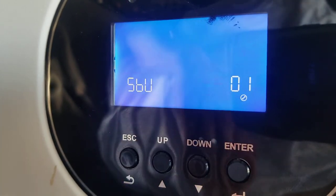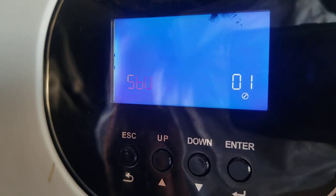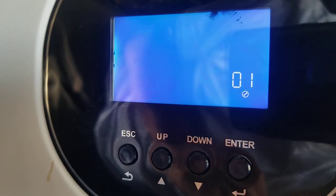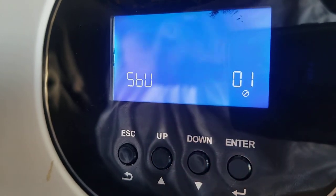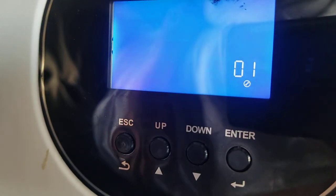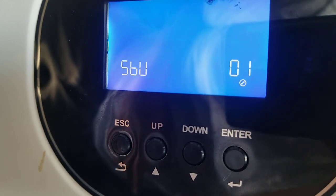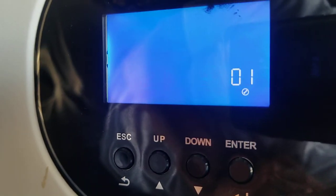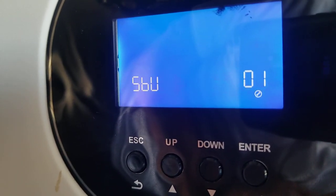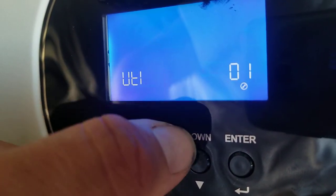And then once solar, or the grid, has raised the battery to a sufficiently high level, depending on your settings, based on the battery voltage, once it's gone up to like 75%, it'll switch back over and disconnect from the grid or shut the generator down, and it will continue to run on solar and battery power. So that's what that setting is. That would be what you would use if you were paying a lot of money per kilowatt hour somewhere. And that's the utility setting.